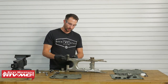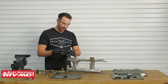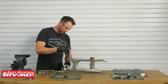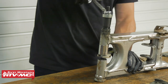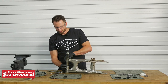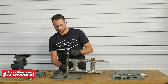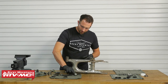These drivers aren't long enough to press the bearing all the way through, so once you've got the first driver in most of the way, add another one to get more length, set the tool back up, and finish driving everything out. If you're pulling everything out this way you'll have to pull one bearing out at a time, and for longer bearings use a deep socket and make sure you're pressing out to the outside. Once that bearing is out, do the same steps on the other side.